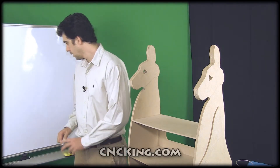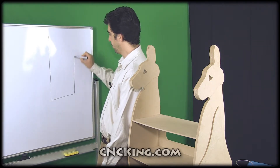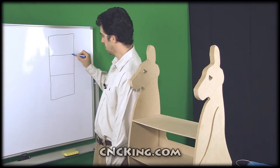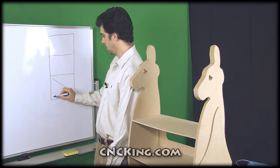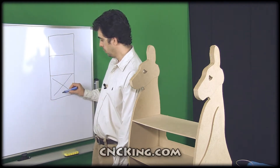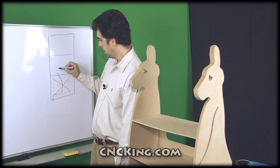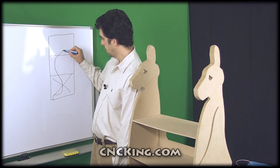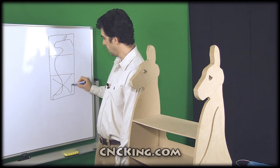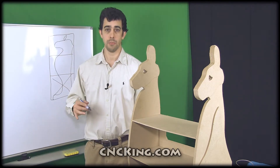I had a very large board and this time I cut it into thirds. This here is the area of my ShopBot Desktop — the maximum area. What I would do is cut out one part: the bottom part of the shelf, then the second part, and then the third part. The challenge here was that as I went upwards I introduced more and more error in the model that I cut.